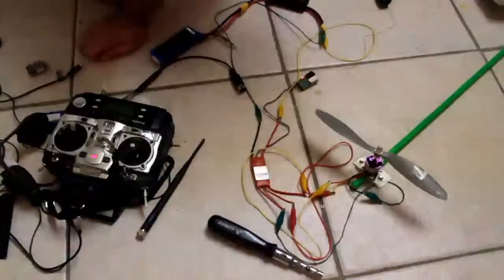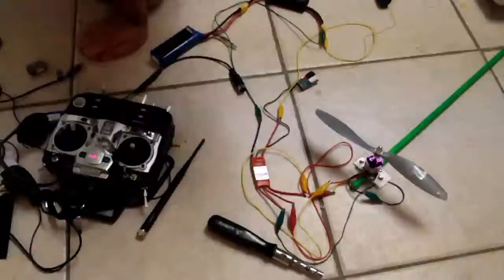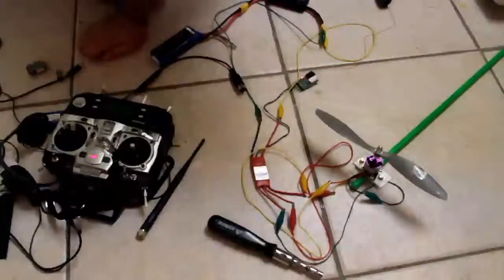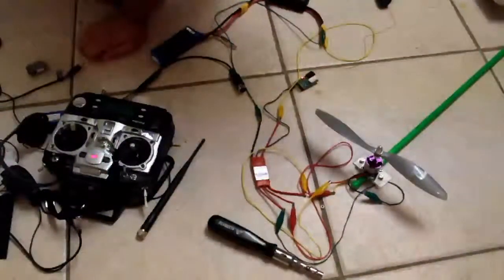It only measured out at 4.92 amps peak. That may be because the gator clips don't conduct as well as soldering it all together — I'm not real sure. I'll be doing more testing. 4.92, almost 5, times 3 is about 15 amps at the most at wide open throttle, plus a little bit of discharge from the rest of the electronics.